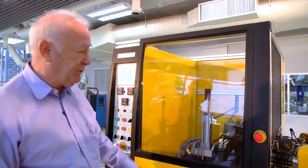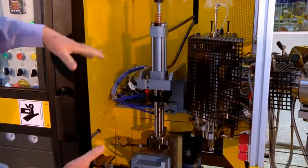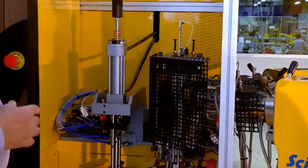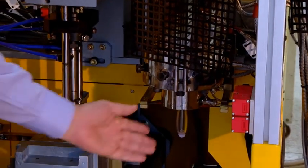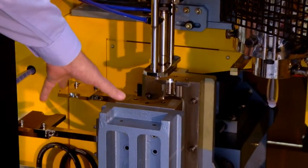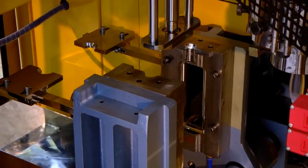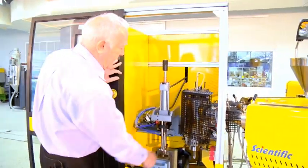And this is the blow molding attachment. It's similar in design to our older blow molding machines, but a little larger for the mold and the die. The die is here, and we're making 2-layer film, so we have 2 extruders, and the parison comes down here. We have a cutting blade that cuts the parison when it's of the correct length. This is the mold, which opens and closes, so this will swing up, close around, and we cut off the parison. The mold comes down, closed, and then the blow pin goes down to blow the parison into the shape of a bubble. So this machine, this attachment, is only single parison and single blow station.